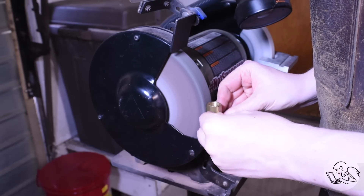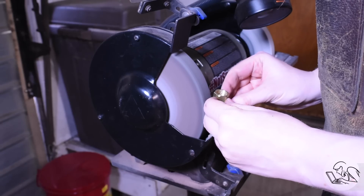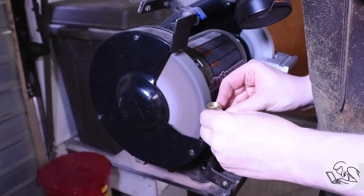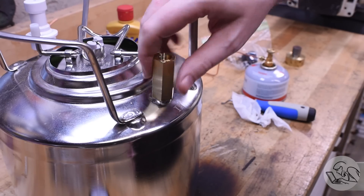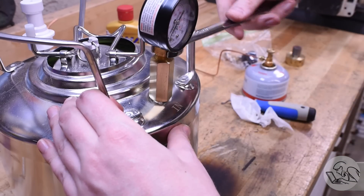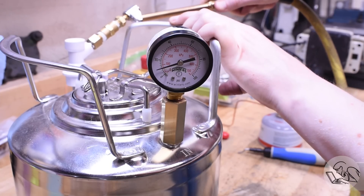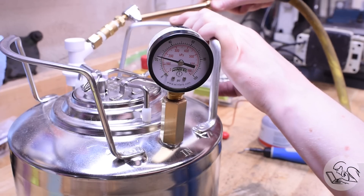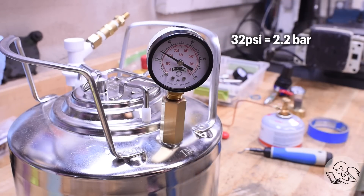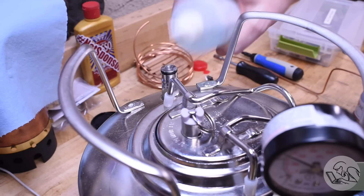As long as we're buying a ticket on the snazzy train, let's go to the final stop — I'm going to buff this up on the scotch-brite wheel. It's going to look very very nice for about two weeks. Now I'm ready for pressure testing. I'll thread my shiny new fitting on there and thread the pressure gauge on there. The modus operandi of this tennis ball rejuvenation idea is that you hold the tennis balls in this pressure vessel for two weeks at a certain pressure — it needs to hold about 32 psi. I pumped it up with my little tire compressor and it was definitely bleeding down, so I did some checking and it turns out it was that plastic Schrader valve adapter that was leaking. I removed that and the basic ball post fitting actually seals extremely well — no sign of leaks there.